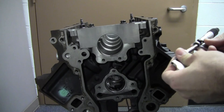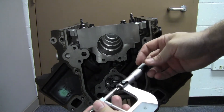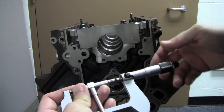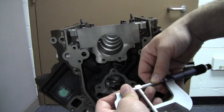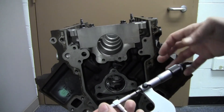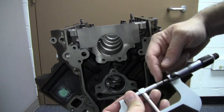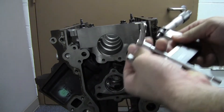And now I'm able to take my micrometer, measure, and turn this in just a little bit till you feel it touch. Now the ratchet stop on my micrometer here doesn't slip before it starts pushing the plungers back in, so you may want to be careful of that. So I'm going to lock it down right there.